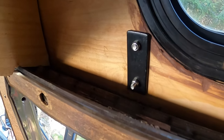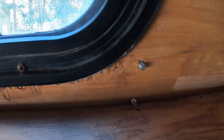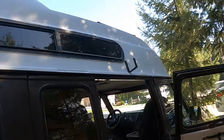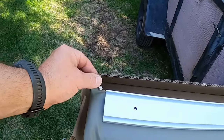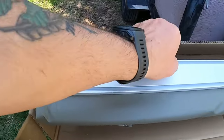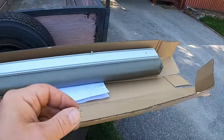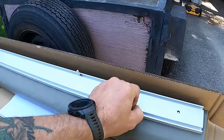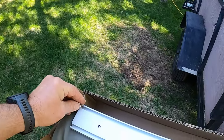I got the one side in. I have to take off some of the trim — I'll just have to cut a notch with these plates, same with over here. I'm going to have to cut that down with a chisel and hammer, but you don't need to see that — it might get ugly. Okay, brackets are on. Now you just slide the bolts provided in the track here to approximately where I'm going to need them, and when I get it up there I can pop it into the holes of the bracket.